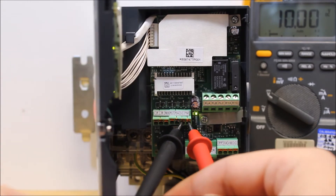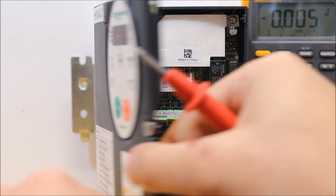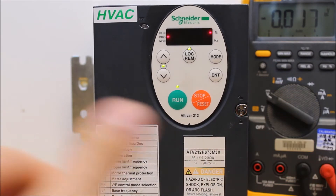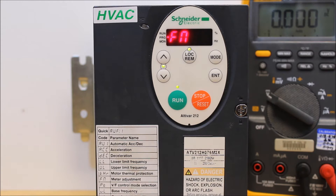So now we can stop measuring with the meter and take it out. Your drive shows 100, flashing. Press enter. The drive now understands that the adjustment has taken effect, and it's now scaled for 0 to 10 instead of 0 to 11 or whatever was shown before.